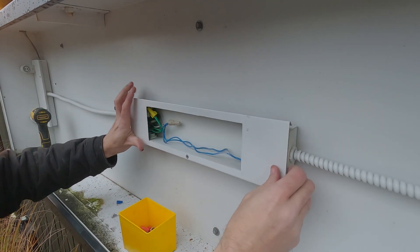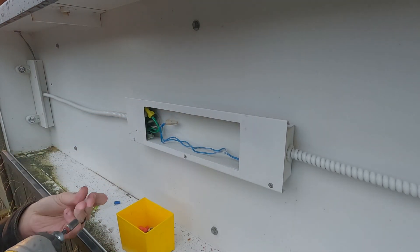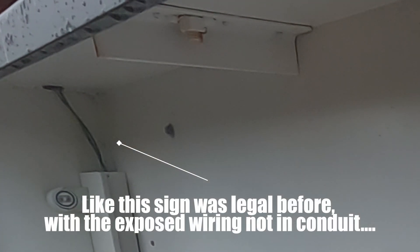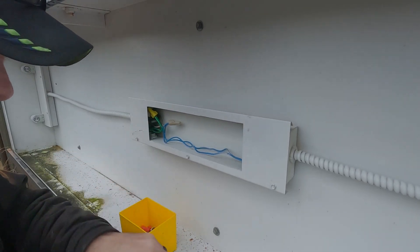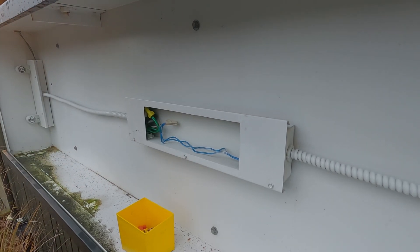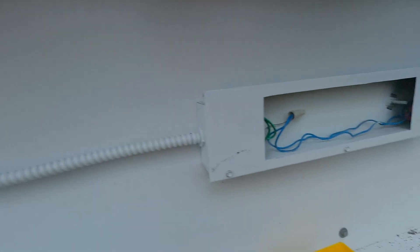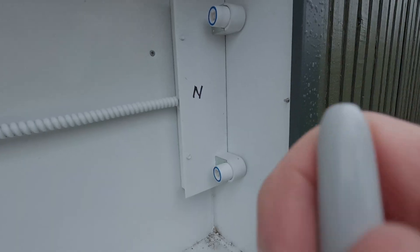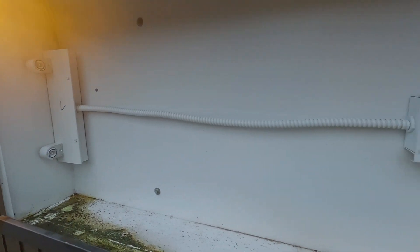We'll put this kind of useless cover back on. That's why I don't like to take the ballast out — then you have just a hole here, and it technically makes the sign not legal. But I've opened tons of signs where there's no covers at all because it's not going to get inspected anytime soon. Okay, so that part's done. Now just take a Sharpie — I'll put an L right there for line, and on this side put an N for neutral. So if anybody does come to service this sign in the future, they'll know which is which. Just make it easy for the next guy.